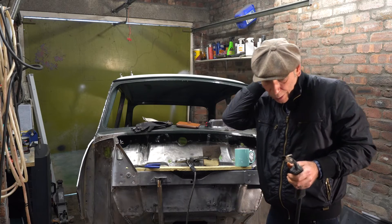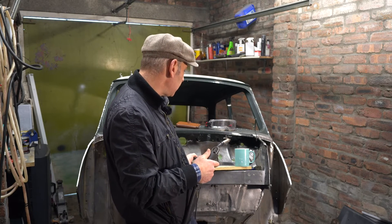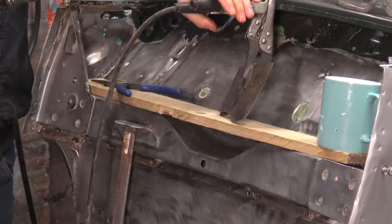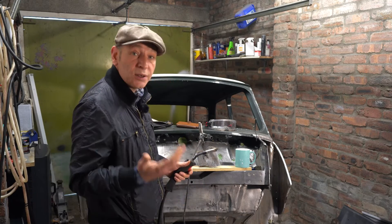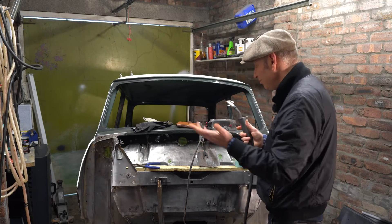The way to dial it in — you've probably been watching videos about the sizzling bacon noise. You'll get a sizzling bacon noise, but you need to get your wire speed right. What I do is put the torch up against the steel, pull the trigger, and turn my wire speed up and down until I get that sizzling sound — that's how you set your wire speed. I haven't actually seen any other videos demonstrating that properly; there was one video where somebody said "set your wire speed" but didn't even show you what to do.